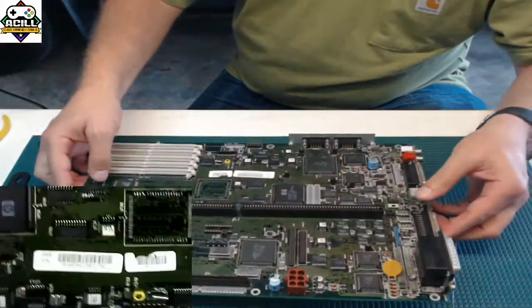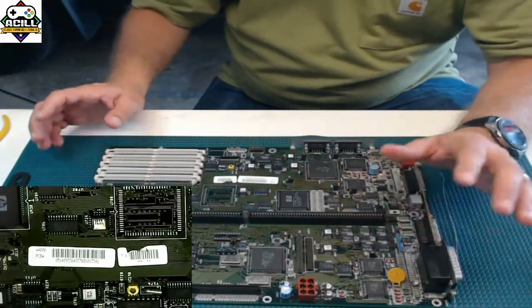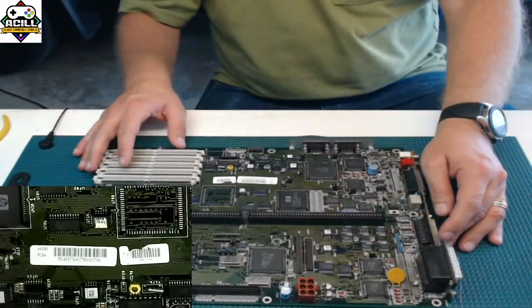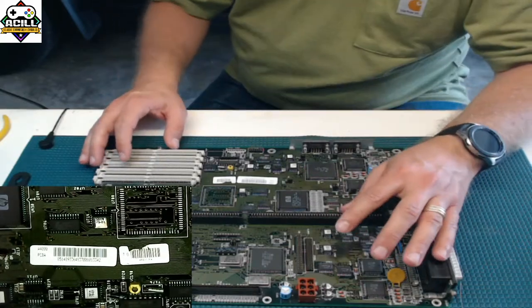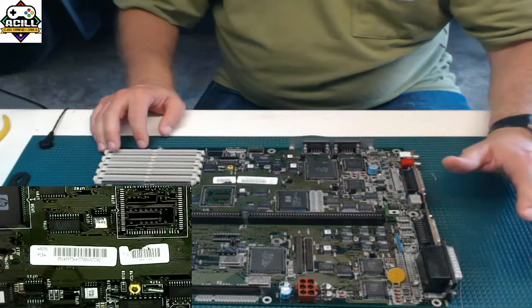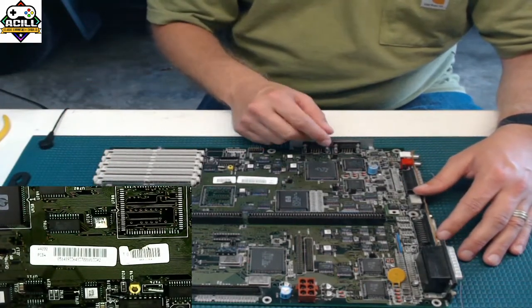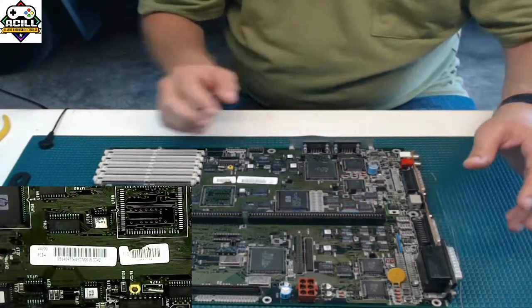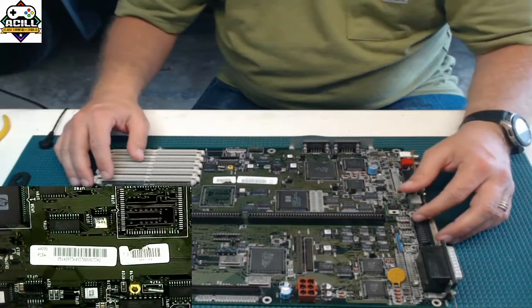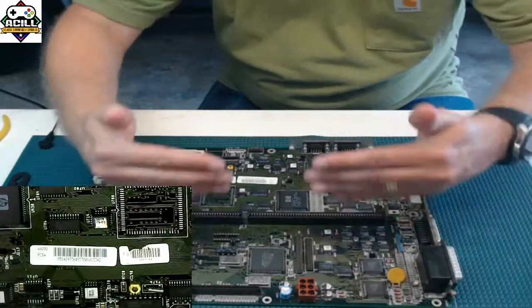What it also allows you to do is help with automation. These boards obviously were not handmade when they were getting pumped out of the factories. It allows you to create a stencil for the top of this board. They'll put some solder paste along one side of the board, and this will go into an automated machine that has a squeegee in it. It usually goes from the top down.